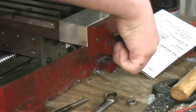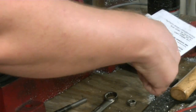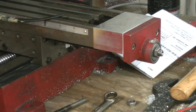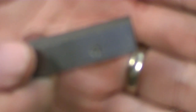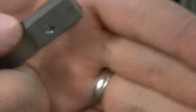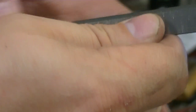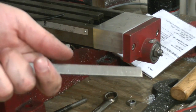That's feeling pretty good — I'm moving it by hand, I'll run it the whole way. It's moving nice now. There's one other thing I found — there's a problem with this. I don't know if we can get in close enough to take a look. This part here that goes along the table — I've got a burr here. The entire length of this thing is just all chattered up. So I'm going to take a stone to this and see if I can get it nice and smooth, then reinstall the gib, adjust everything, put the motor back on, and I'll bring you back a little later to see how things went.